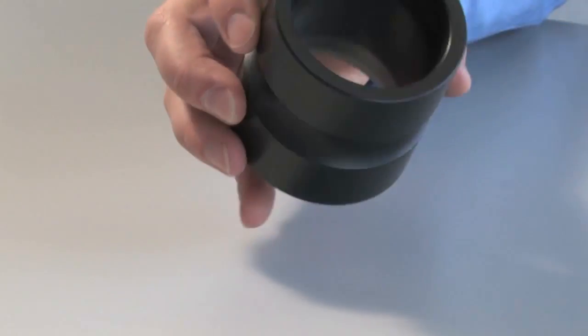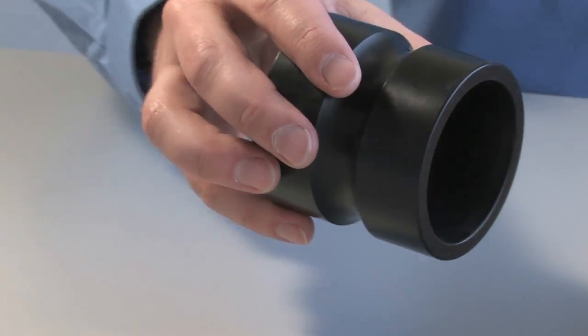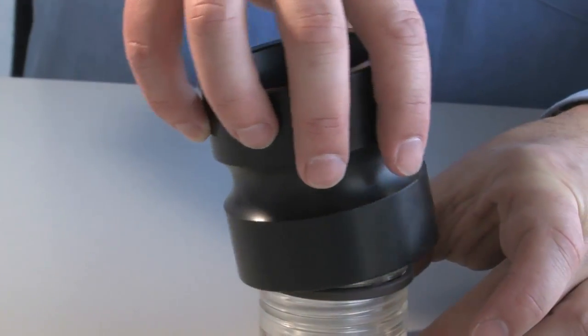The sealing component must be calibrated after PTFE compact seals have been mounted by using the sleeve.